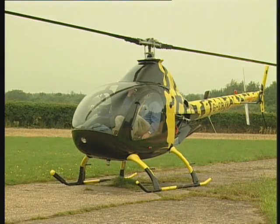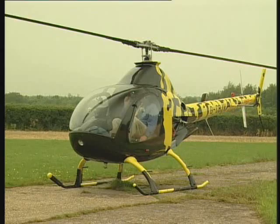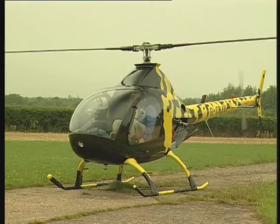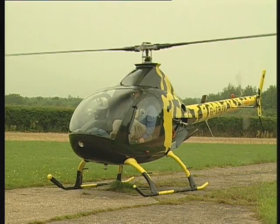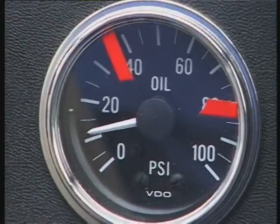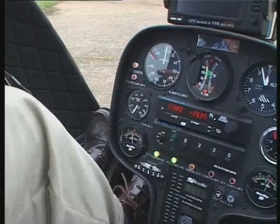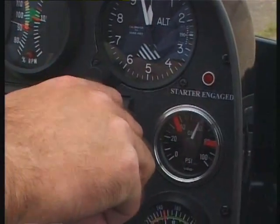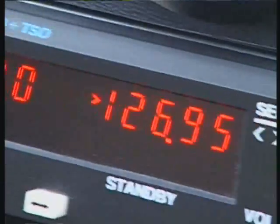Okay, we're good. Instruments are on and the key is on. Let's start the rotors then. Engage. Okay, that's started quite nicely. Clutch going in. Oil pressure is rising. Alternator is on. Beta 2 is on. Put the GPS on and the transponder, just in case we have to talk to Stansted.